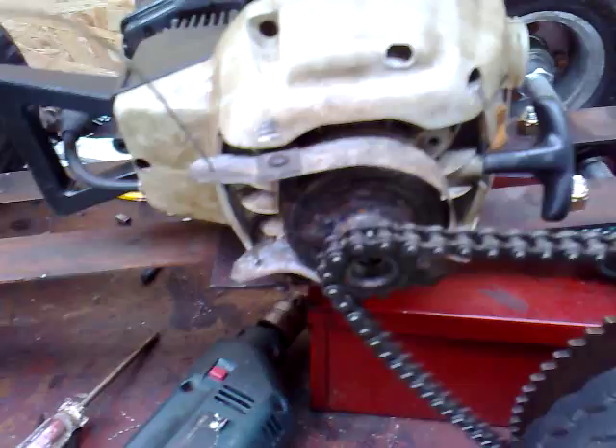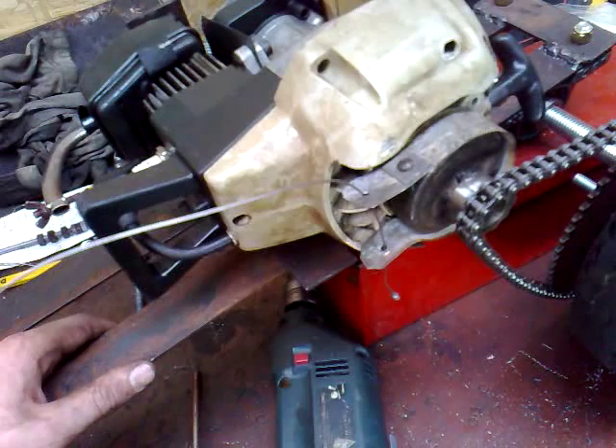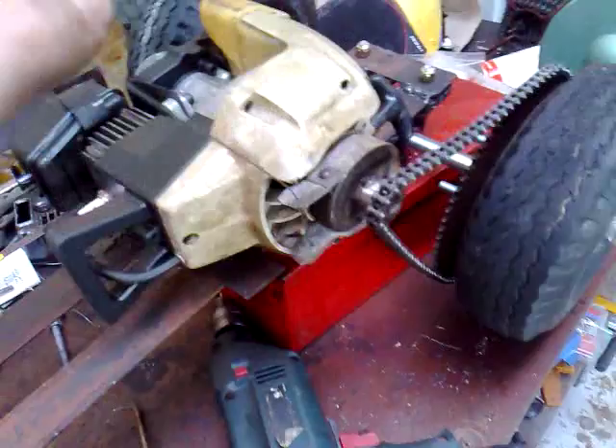I can't really show you, but that should work well. This won't be in operation for a while — I'll just have it sitting on there. Basically I need to get another 15 kilogram servo and replace the throttle servo with that one, so when it goes one way it throttles and when it goes the other way it brakes. I have one servo for both the brake and throttle. I need to get another one of those MG995 servos and hook that up.